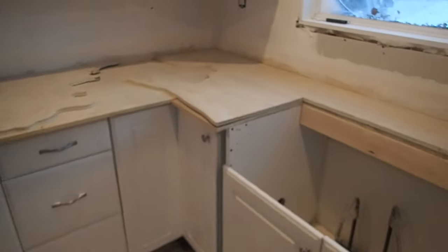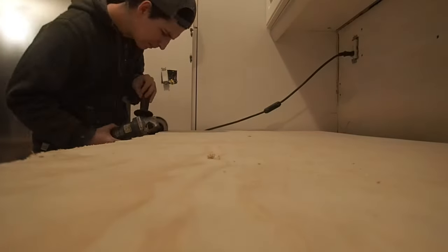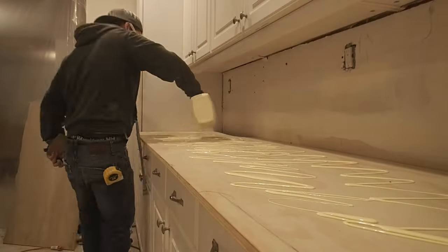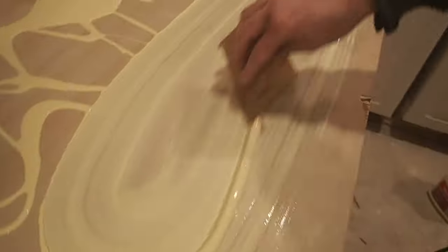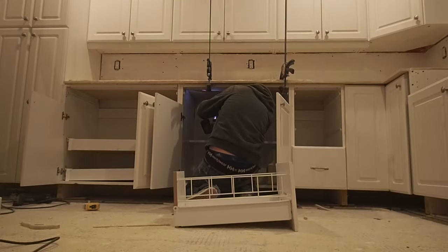I was doing an apron sink on here, so I had to take that into consideration as well. After I had it all cut, I basically just hit it with the electric rasp to refine the shape and make it fit on the bottom layer, then sanded it quickly with the orbital. After doing all the shaping with the electric rasp and sander, I glued them together, then also screwed them — and some of the screws poked right through, but that didn't matter.